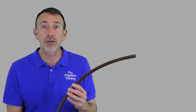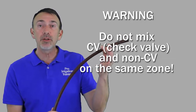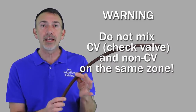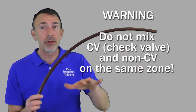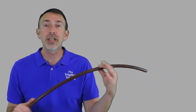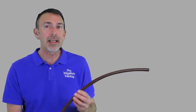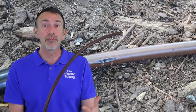You can also get this drip line with check valves in between each dripper, which saves water — when the system shuts off and the valve shuts down, it traps the water that's in the line. Otherwise, if you didn't have the check valves and there was any tilt to the ground, the water may accumulate at the end of the leg and push itself out. What we're trying to achieve in agricultural and landscape situations is a very even watering and a very high level of uniformity.